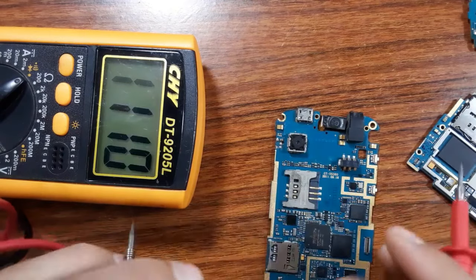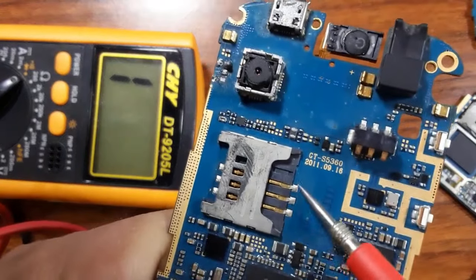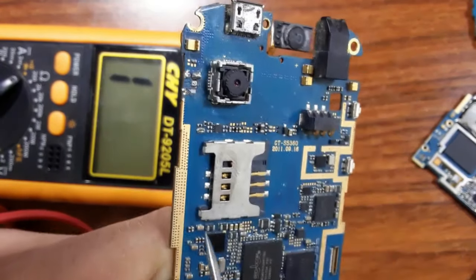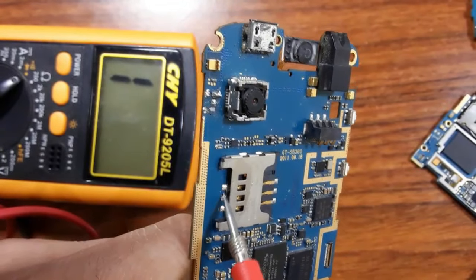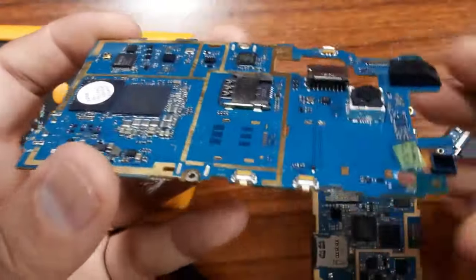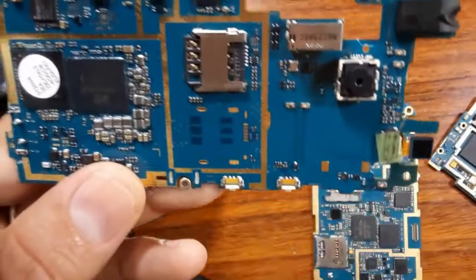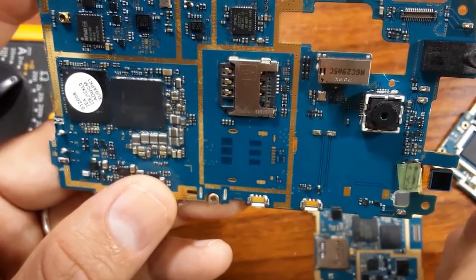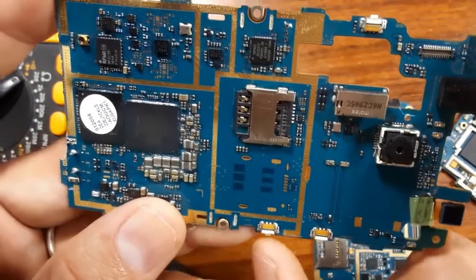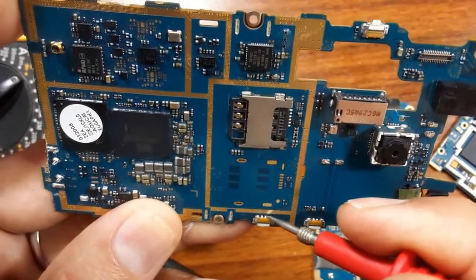And this, as you can see. And for the same connector, check the soldering. If you have a bad soldering, make another soldering. Also for this, if you have a bad soldering, make another soldering. So I want to add that also for the switches, the same working principle. I get some cell phone boards with bad switches, and always I find a broken switch or a bad soldering.